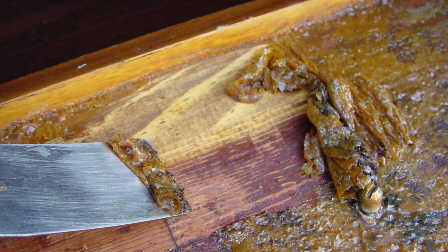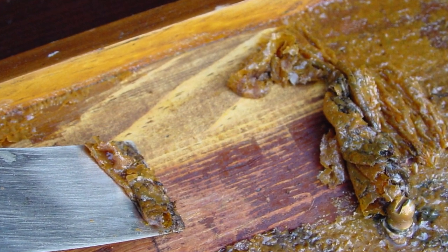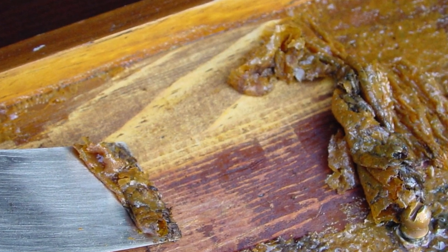You're going to want to get a bunch of pretty heavy paper shop towels so you can wipe and work around the spindles and the handles. Maybe a little bit of light scraping, but one thing you want to avoid is going through what's called the patina of the old finish. This would be a natural darkening of the wood that takes place slowly over decades and gives that antique look. So you don't want to get down to bare bright wood, which you could do if you stripped too vigorously. Do what you can with a stripper — that's going to remove 90–95% of the gunk that's giving you grief.